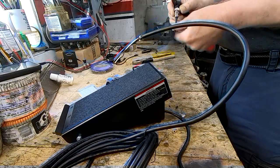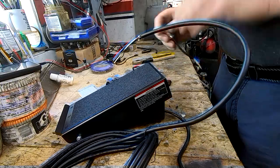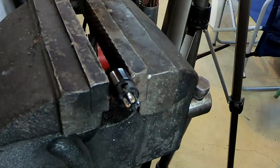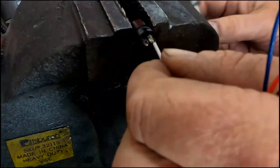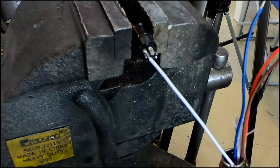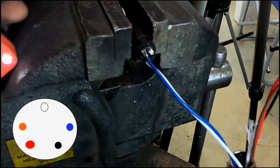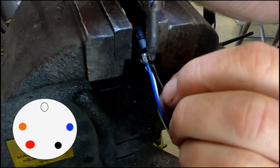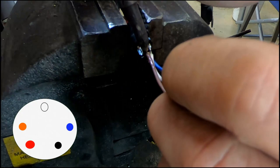The stock cable that came with it only has two wires connected — basically just the on/off side. So I need to get into this to pin out the rest of the wires. The first couple of solder connections are those same on/off connectors for the foot pedal. On the other side, the brown and red wires are the variable wire connections.